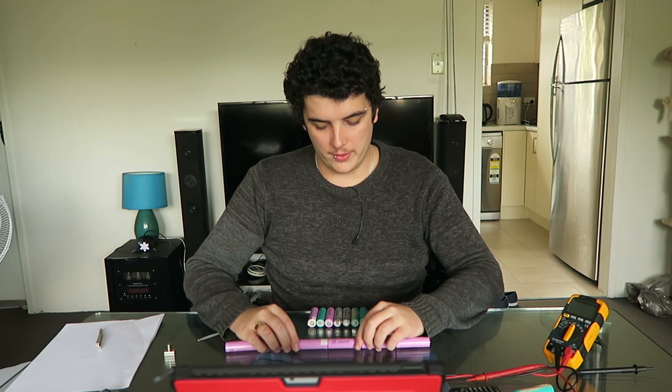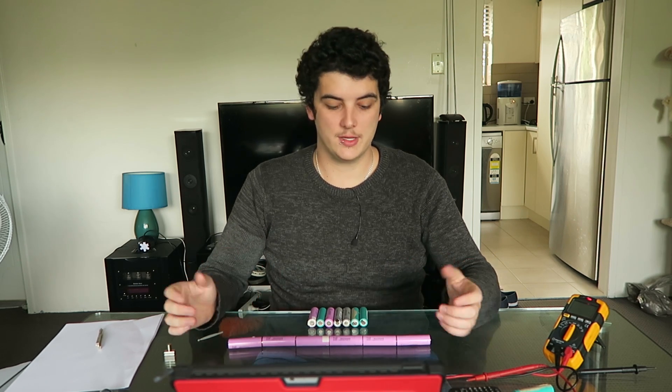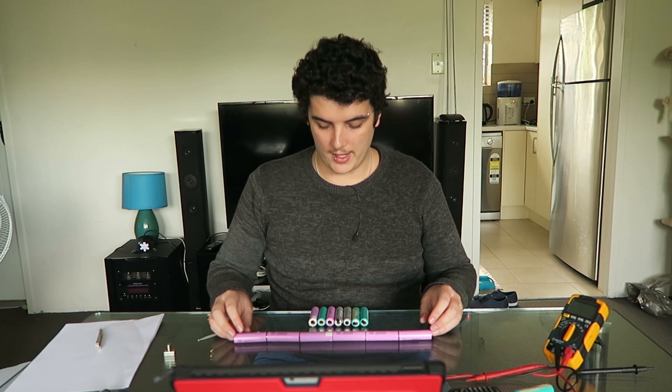If we have a 250 watt electric bike motor — well, watts is just voltage times current. So to get the current, it's wattage divided by voltage. So 250 divided by 24 equals 10.4 amps. And how much did we say we want to draw from each battery? One amp, to be safe because we don't know the origin of these batteries or their life. So if we hooked this up to the motor now and kicked it over, it would run — but this battery here would be seeing 10.4 amps, and we only want each cell delivering one amp max.